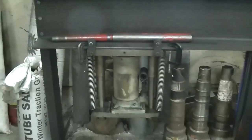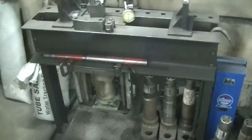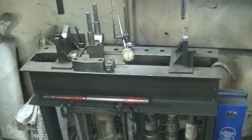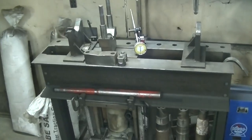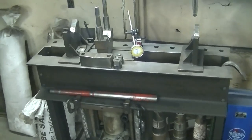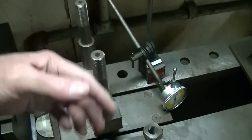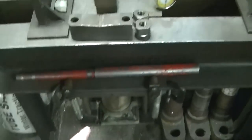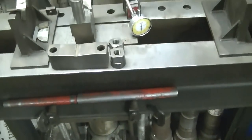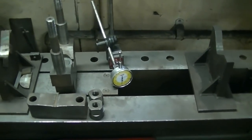It's not my idea — it's plagiarized from something I saw years ago in grinder shops. If you get a lot of features on a shaft, go on a cylindrical grinder, and it's got to be straight, and now you've ground it with a lot of money in it — what do you do, throw it away? No, you straighten it. They would have a link with a hook they could flip out of the way, and mine will too — it slides the length of the frame, because you don't always pull in the middle of a shaft.